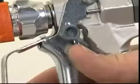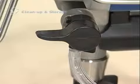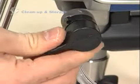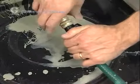Turn the power switch off and turn the prime spray valve to prime to relieve pressure in the system. Turn off the water to the hose. Go ahead and remove the power flush attachment and unscrew the garden hose.